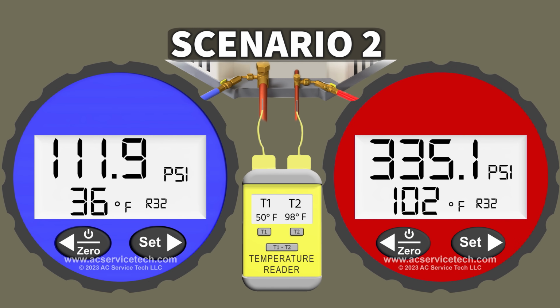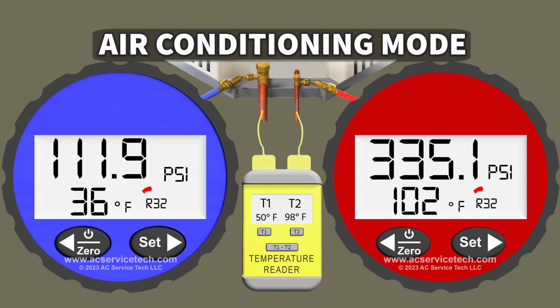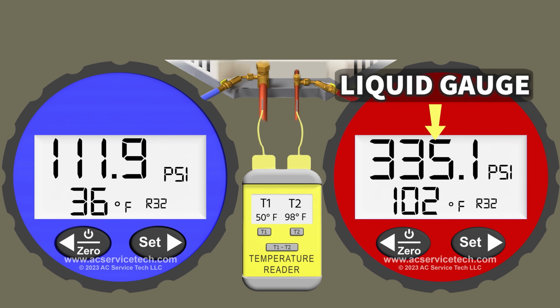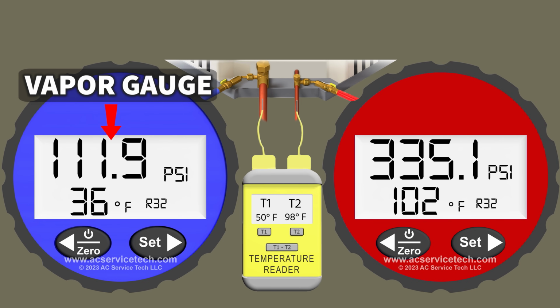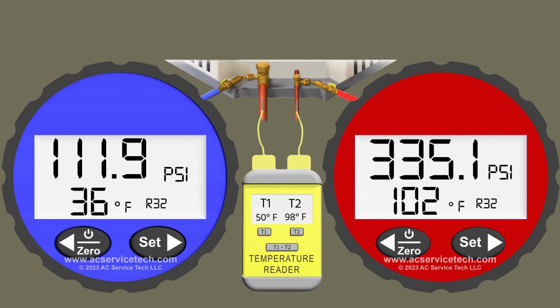So in this scenario, we have a two-stage outdoor unit, and it's running in air conditioning mode with R-32 inside. We're measuring the pressure on the small liquid line first. So we have a pressure of 335.1 psi. We convert that to a saturated temperature of 102, and we also are measuring a line temperature of 98 degrees. We also have a vapor pressure of 111.9 psi. We convert that to a saturated temperature of 36 degrees for the R-32 in the middle of the indoor coil, and we have a vapor line temperature of 50 degrees.